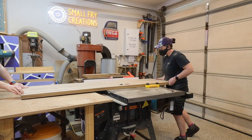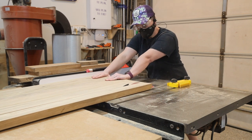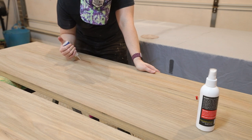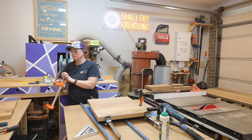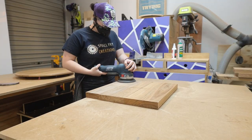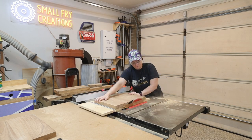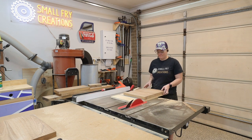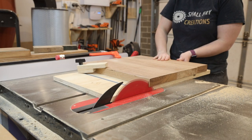The panels were a little hard to handle but the mag switch feather board helps keep the panel up against the fence. Before I continued to sand I used some Starbond CA glue to stabilize some of the cracks in the timber. It was then time to get the smaller panels out of glue up and rough sand them. I used the table saw to cut the pieces to width, and used my tapering jig to create one straight edge on the boards before cutting them to the right height.